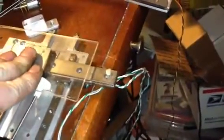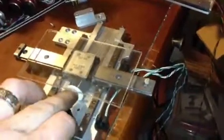And then I'm actually going to use these NEMA 11 linear steppers with a Delrin nut on them for the actuation. So this will get mounted under here and get mounted right there, and it'll be able to move the table by twisting its lead screw. And then same thing for going this way.